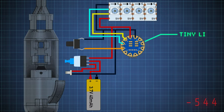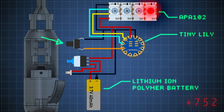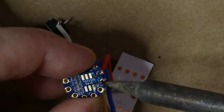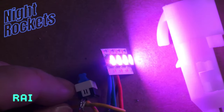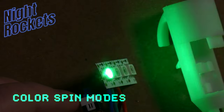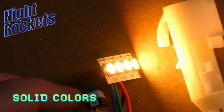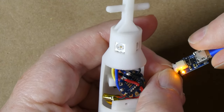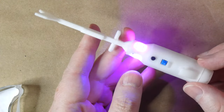Here's my circuit. If the switch is pushed in, it connects the battery to power it. If the switch is out, it connects the battery to a plug where you can recharge the battery. The push button switches modes for the LEDs. There are 19 modes: the default is a rainbow gradient, then a rocket fire mode, a blue rocket fire, and a purple rocket fire. There are modes with different colors spinning around, a patriotic spinning mode that looks a little like an emergency vehicle, and then different solid colors. The last mode is a special one I'll tell you about in a minute. The electronics all fit inside the rocket — to charge it, plug it in and turn off the switch. It takes about 40 minutes to charge. Let's turn it on — yeah, that's pretty cool.